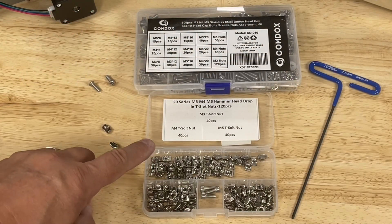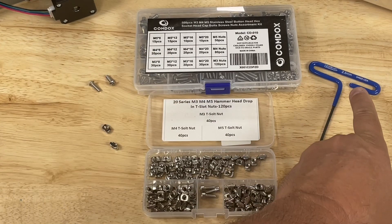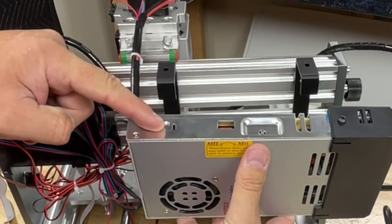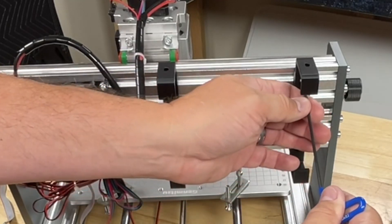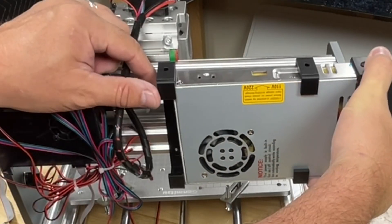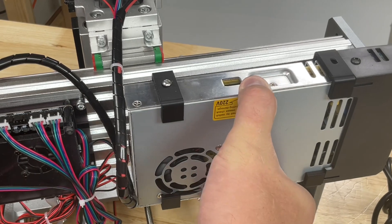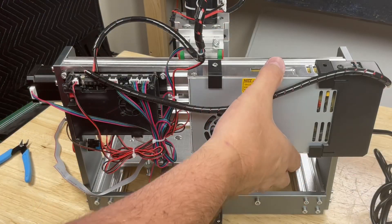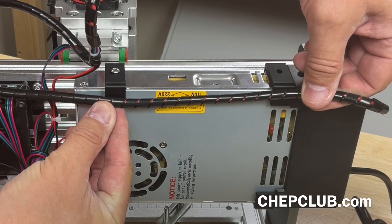To mount it to the back of the CNC machine I used M4 T-nuts and M4 by 12mm screws, which require a 2.5mm allen wrench to tighten. I put the T-nuts in place with the screws, mounted them to the rails, lined everything up so the screw hole on the power supply was aligned, then removed the wire to get it in place. After tightening everything up and sliding the power supply into position, the screw hole lined right up and I secured it with an M4 by 8mm screw. Now it's solid — I just need to reconnect the wires. The only thing I'd change is adding clips to hold the wire, but maybe that's for a future print.